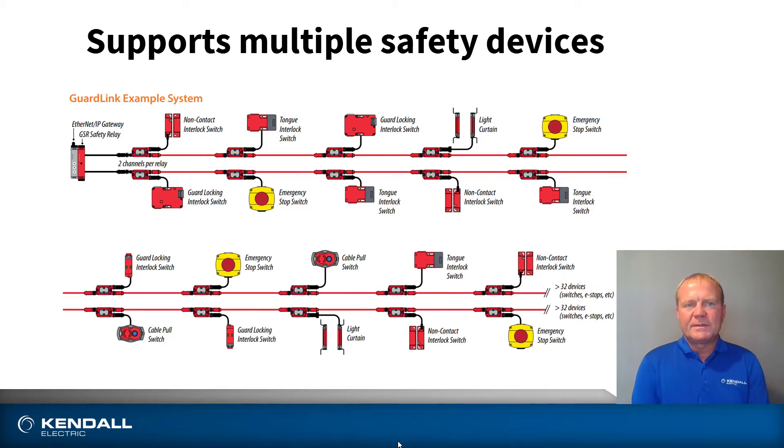What's great is that you can put an ethernet adapter on there — you can see it to the left of the screen. This takes the signal to the Logix controller, and then you can get full diagnostics back to your controller, display it on a PanelView, and get instant notification.